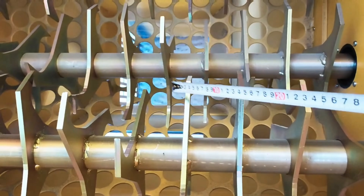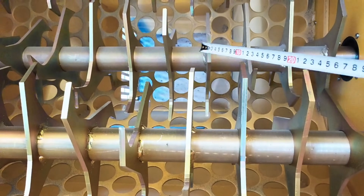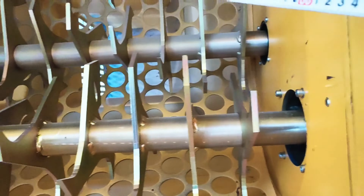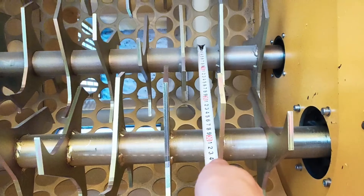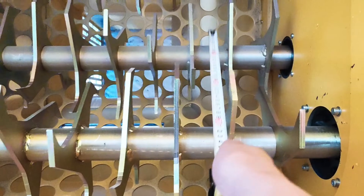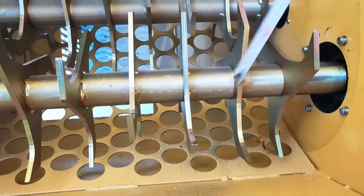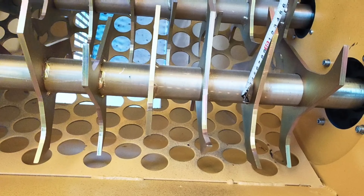As you can see from the video, four pieces of cutting shaft are crossed over each other during the operation to ensure the efficiency of the entire cutting process. Cutting blade distance 70 mm. Cutting knife edge to edge distance 50 mm. Cutting knife shaft distance 300 mm. Cutting knife shaft diameter 50 mm.